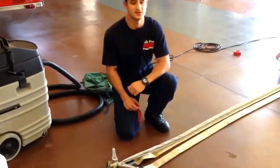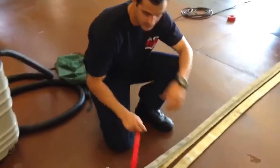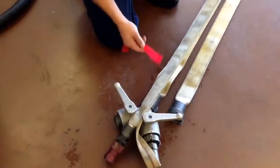After your partner pulls tension on the inch hose, you will then see your final product. The inch hose is laid on top of your inch and a half, and you will then tie it off approximately every 10 feet with flagging.